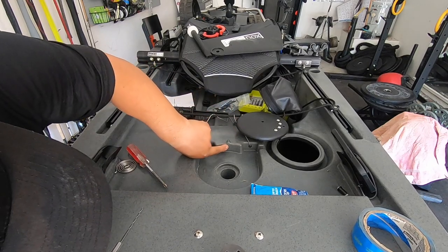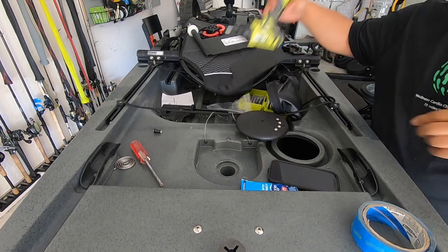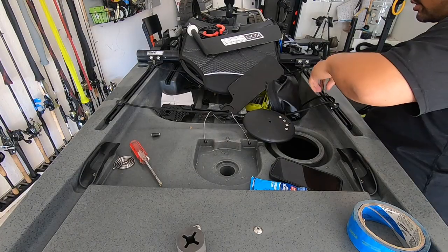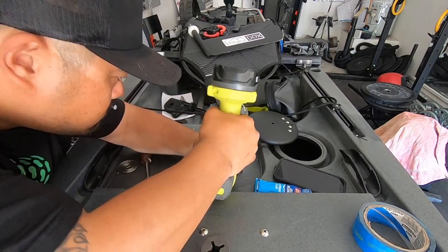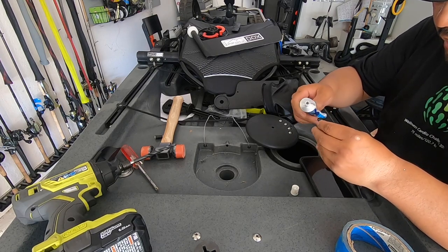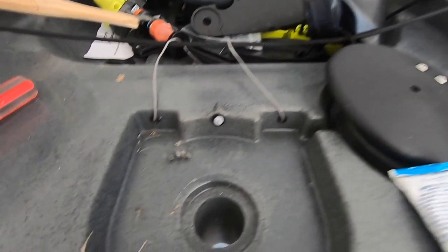It looked like it was a little flush on top, maybe around a little bit lower. I want to feel underneath — I can feel underneath right there. There's a little indentation there. There's a little pilot hole right there. I want to make sure I do it right because you only make a mistake once. Now using a 5/16 drill bit — when you get in there you want to hammer it in. The hole is really small — they did that for a reason because you've got to hammer it in. Put in a little marine glue — you don't have to, but I'm doing it anyway. Using a rubber mallet — it's smarter to use a rubber mallet.